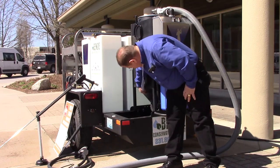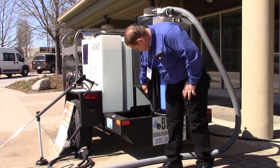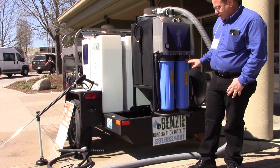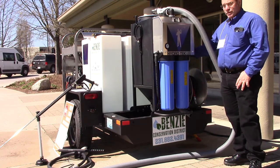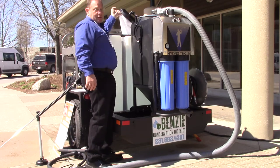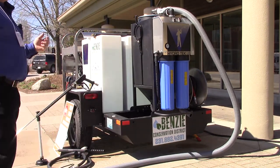There's a transfer pump mounted on the back side that sucks water from above, trapping anything heavier below as solids. It pumps the water up through a 50-micron string filter, then through a 20-micron string filter. The transfer pump then sends the water back to the tank, where inside there's a five-micron large-capacity bag filter that catches everything down to five microns. After that, the water can be reused.